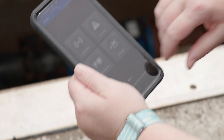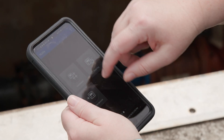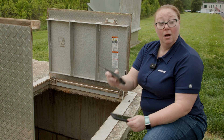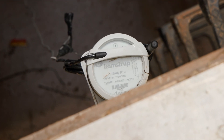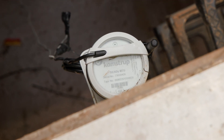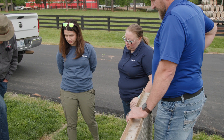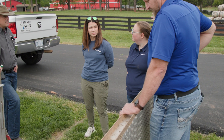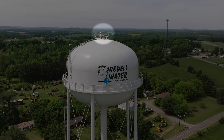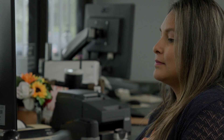What we did is go to our Reedy app, hit send/receive, and then from there hit installation. We make sure that we're paired with our converter and hit install MTU for AMI. This is the serial number and the barcode for this MTU. We tell the meter at the point of installation that the MTU should communicate to this meter and send the reads to what we call the meter transmission unit, which then begins to see the collector and communicates those reads to the collector through the cloud, so that in the office they're able to see the read from this meter.